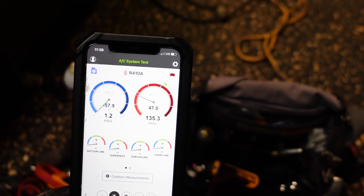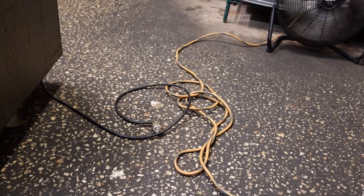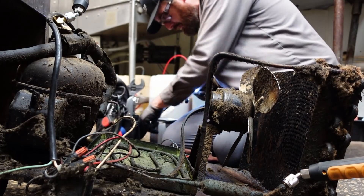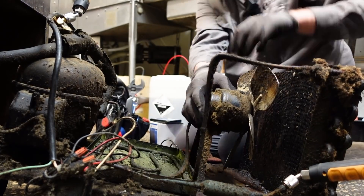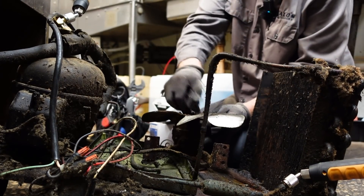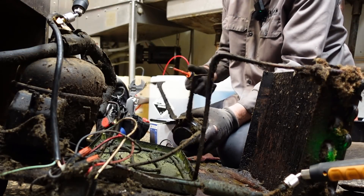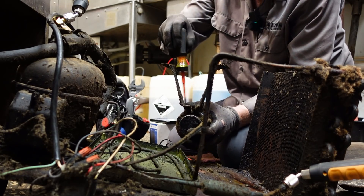Clean out that coil. Not sure which gas this is. The evaporator's not running right now — I have it unplugged. I'm just plugging the condensing unit directly to a cord. That's the normal whip from the unit. Let's see what we got here. These screws are pretty old — only one of them is a hex; the rest are domed, slotted screws.